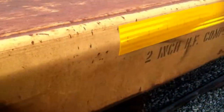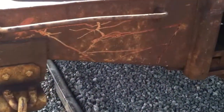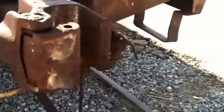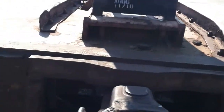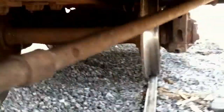At the shallow section of the center sill, you can see something was kind of scratching this thing up here, but that's pretty minor stuff — there really isn't any damage to this car, very minor. And you can see the rub rails right here — there's a little bit of damage, looks like when they're loading something they got a little bit of damage, but those get cut off anyhow so it doesn't really matter. Let's take a look at the center sill — looks really good. C7 by 12.25 crossmember over there, that'll be the X1 crossmember. Great looking longitudinal crossmembers. That's all there is to it.